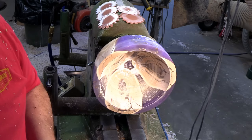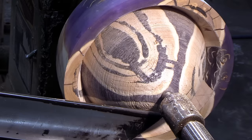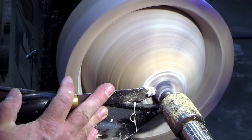Just showing that I've ground down a little flat spot for the live center to sit. I'll use the large outer bowl, reverse it, and get a flat spot turned on the bottom, because I do plan on putting a glue block on the bottom as well. Every time you put a tenon on the bottom of a bowl you're going to take away a quarter to half an inch in height. This is another reason to go with glue blocks as opposed to turning tenons on the bottom of your pieces.